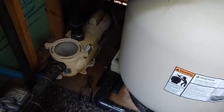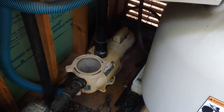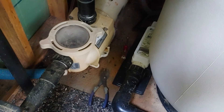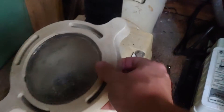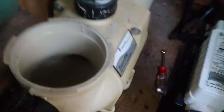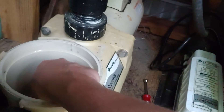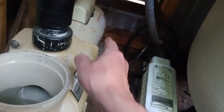One of the things you want to do is check if the pump will spin. Take your skimmer basket off — it's going to look different for different models. With all power off, not just the breaker, you can reach your hand in here and spin a tube inside. That indicates your impeller is spinning and your motor is not stuck.